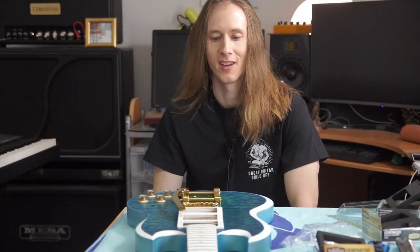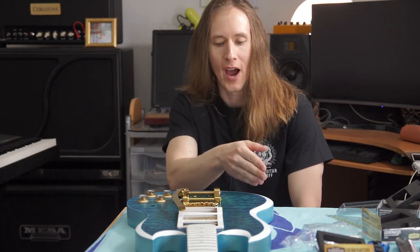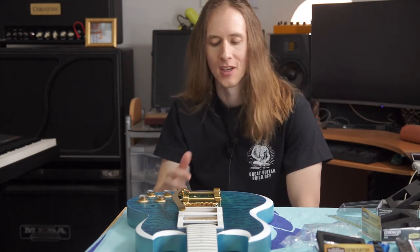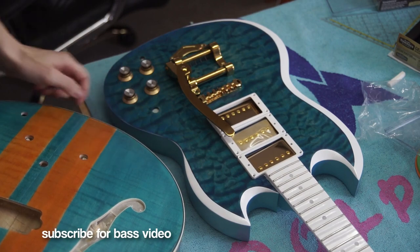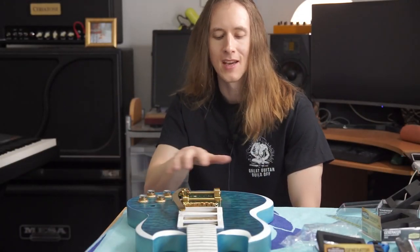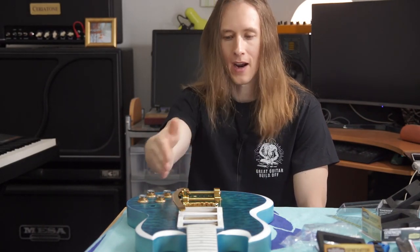This isn't really working. When I masked off, I realized this white is way too bright for this now darker than expected blue top, because I've used the same wood dye on this base that I'm working on, and on there the blue is much lighter, but the veneer on the base was much paler to begin with. I've been thinking on how to proceed. Unfortunately, I don't have a more cream looking white to spray on top.